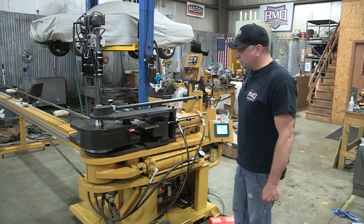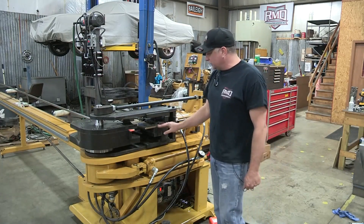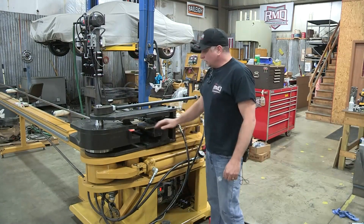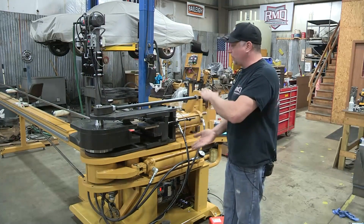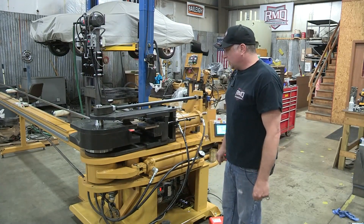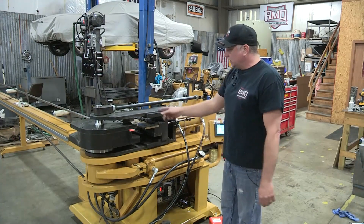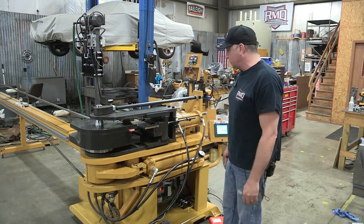One different thing that we do versus some other machines is we use leaf-style tooling, which means that the tubing is captured, and this is considered a leaf on top of it, versus an actuating top clamp die. We have much better control of the material as it's fully trapped and it comes apart real nice, so it's a real nice tool design.